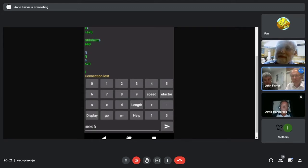I'm hoping that different students will be at different stages doing different things. We'll encourage people to look at, for instance, how far ahead the sensor is. We've got the line sensor on a pair of wires there, and they can experiment on dragging it right out the front, or changing its height, or bringing it right back into its original position. And we did find this made quite a difference. If you use falling off as an option for slowing the motor down, then if the sensor's way out in front, you get more warning and it works better. So some students will be looking at that.